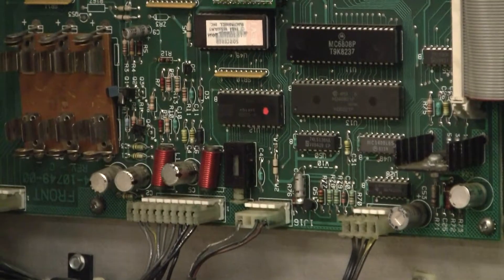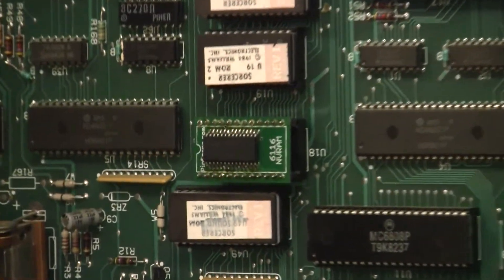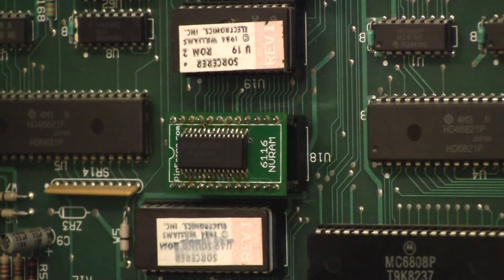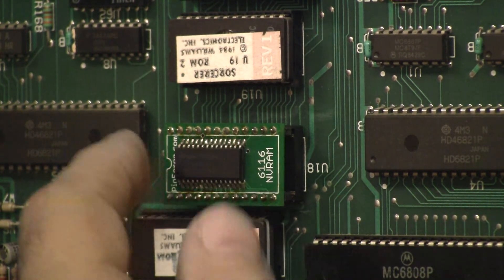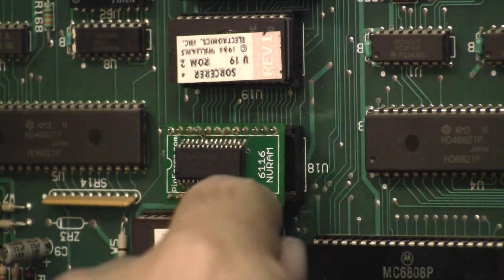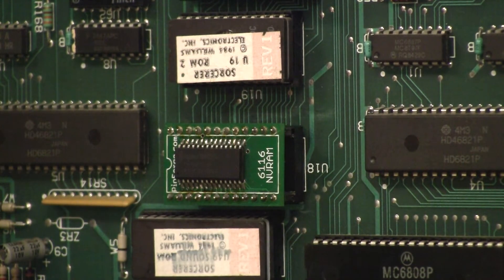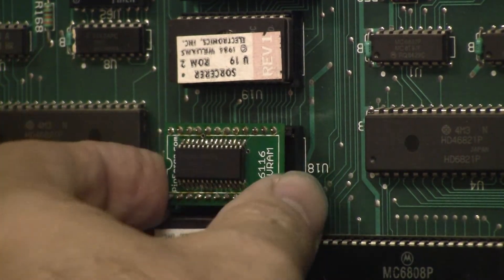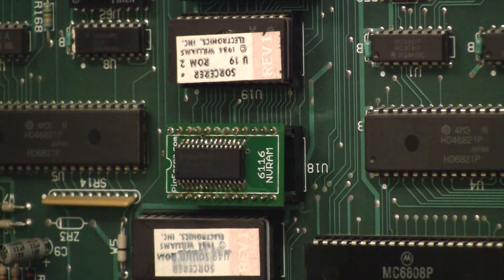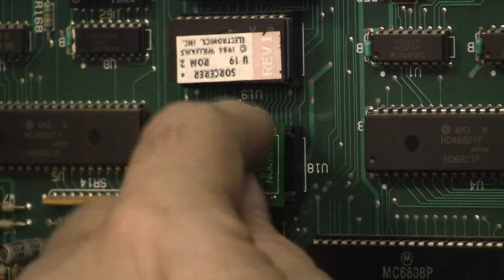Let's zoom in on U18. The conversion has already been made, and you'll notice it's pretty obvious which chip it is. You see this little piggyback chip there? This is a 6116 non-volatile RAM that's been fit to a small circuit that will fit the standard DIP24 24-pin memory chip that was in there. It was a 2K by 8 memory chip — just a standard RAM that was battery backed up. So we've taken a more modern chip that's been modified and fitted into there.